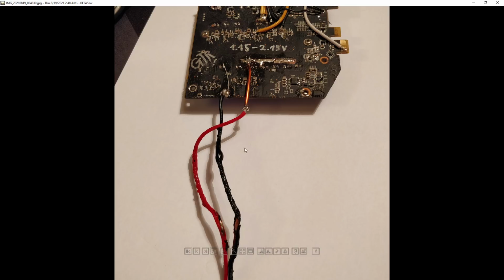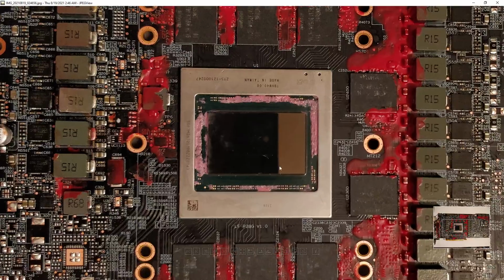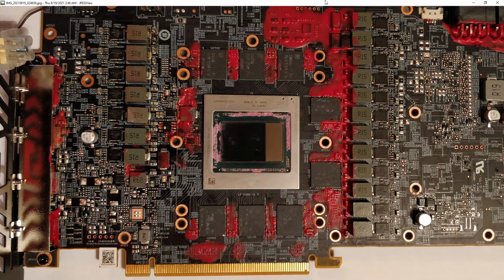And so at 0.95 volts, pulling this much current basically means that core is, for all intents and purposes, I think the internals of this are basically just a nice jumper. This is basically a jumper now. This isn't a functional piece of silicon anymore, at least not on the V-core end of things. But yeah, super shorted out, and if you just remove the short circuit, the VRM fires right up.